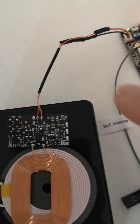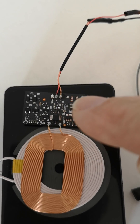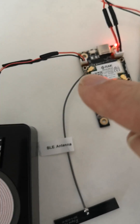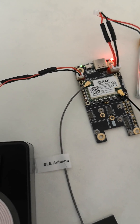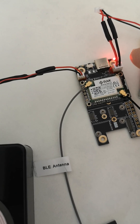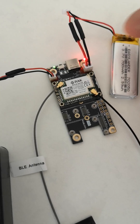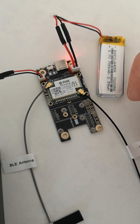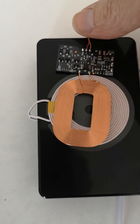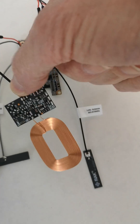What I've done is connected the output of the receiver for the wireless charging to the solar input for the WizzBlock board, and the battery is connected to the battery terminal because the battery is supposed to be 3.7 volts. You can supply it with 5 volts from the USB port, and the solar input accepts a maximum of 5.5 volts. In this case, I've used this wireless charging circuit instead of a solar panel.